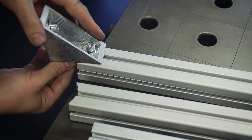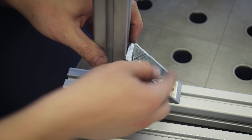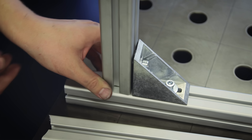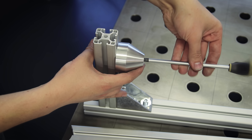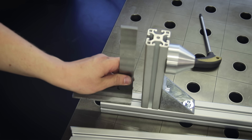Here are all the finished jig parts — let's start assembling. There are different types of T-nuts depending on the system but they all work the same way: the screw goes in on one side, you fumble them into the T-slot, slide them wherever you want, and when the screw is tightened it forms a very strong joint. The other side of the angle bracket gets a vertical piece attached, and then the cones are also installed using T-nuts.